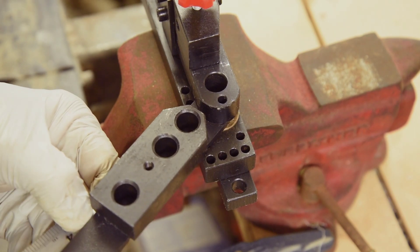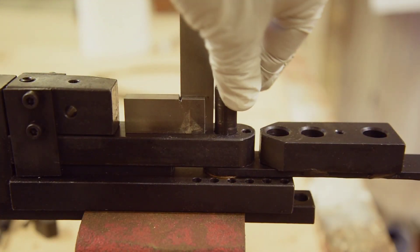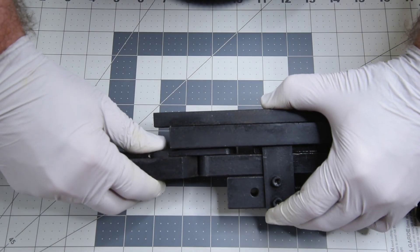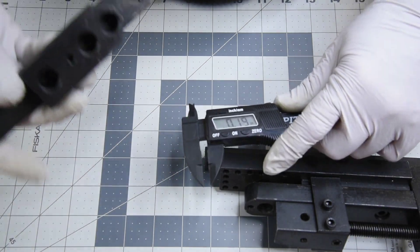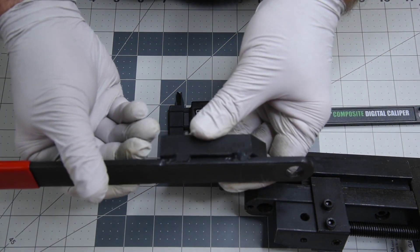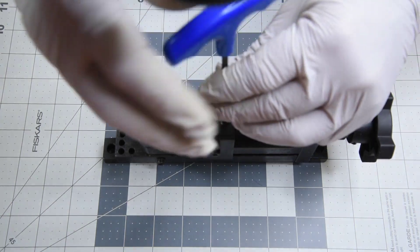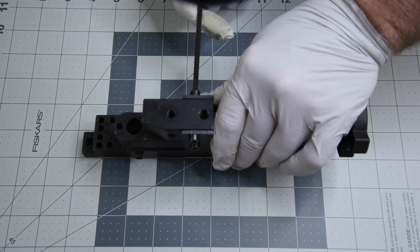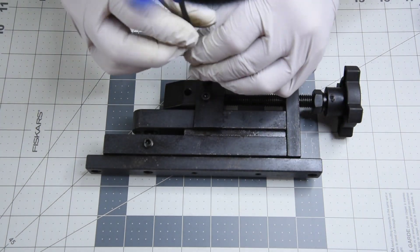There is still some slop in the pins themselves. The handle does bend some, and the center pin is not quite square, but it is now quite usable. Let's do a quick teardown and see how it's put together. The bar of the handle is 5 millimeters thick and has a block welded to it to hold a pin. The entire tool is made mostly of rectangular bar, drilled and tapped, with a piece of threaded rod with a plastic knob. It really is a neatly made tool, and the whole thing is held together with cap screws.